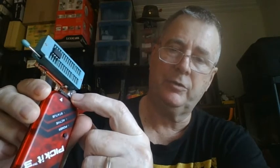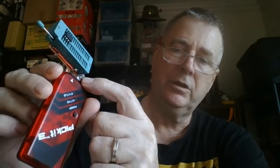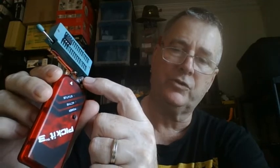There's my 10K resistor there. There's my output, that's my output LED. And it has the added advantage that it's on the TX line for programming, so that'll blink quite nicely when it's programming the chip. So you know that data is flowing between your PICkit and your chip. So that's quite a nice board. You can use it to program your chips as well. So it's got more purposes than just this particular test application, but it's a good thing to have. So we're adopting that, and that's going to be our test platform, and we're ready to rock and roll.